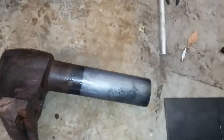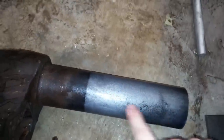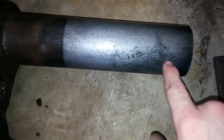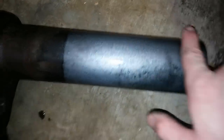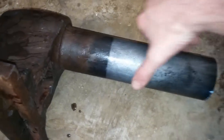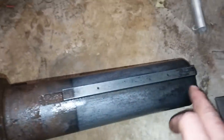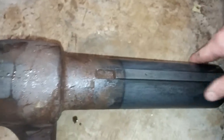Here we are the morning after. This is the dynamic jaw, partially cleaned. The water line of the tank basically went up to about there. This is after using my brass wire brush and some scotch pad — you can see it's cleaned up significantly. There's still some black patches here that are kind of rough, so I'm going to wire wheel that off a little bit as well. Just kind of feeling along here for any abnormalities — that feels smooth all the way down. Just have a couple of spots to fix up. Looking pretty good — just going to do a little bit of touch-up work and then do the other side.